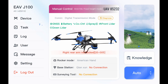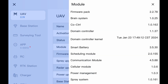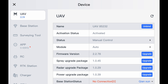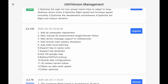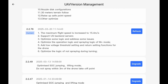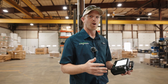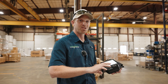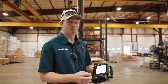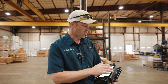We're going to go into our device tab — the drone's connected to the remote. Here on our device tab we can go into our module and look up everything, going through one by one. The firmware version here is for the drone itself. If you hit upgrade, you can see the latest version came out this month. It was not updated because we just got it back, and even the version from April wasn't updated. They did update in March, but when they shot the video they were on the firmware version from January — the first U.S. firmware version, which had a lot of bugs. When we transferred from the Chinese firmware to the U.S. version, a lot of things got lost and we had to do a bunch of updates to fix those things. So there were no firmware updates on the UAV.